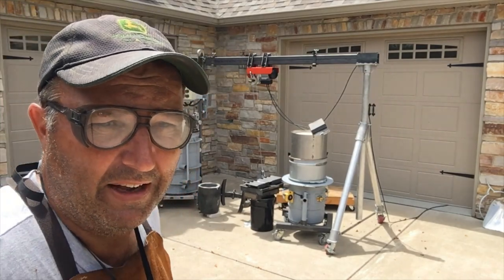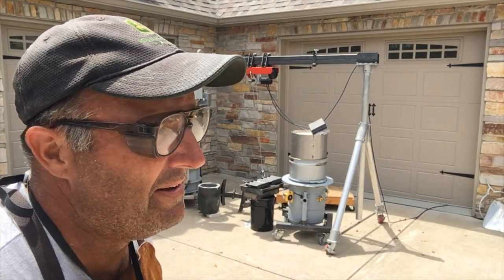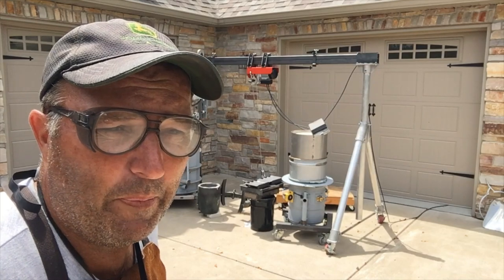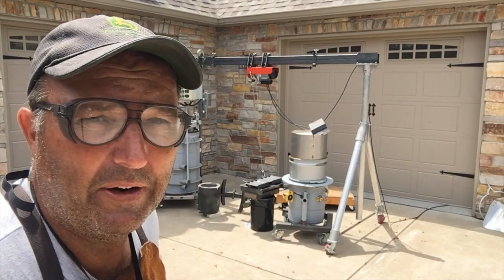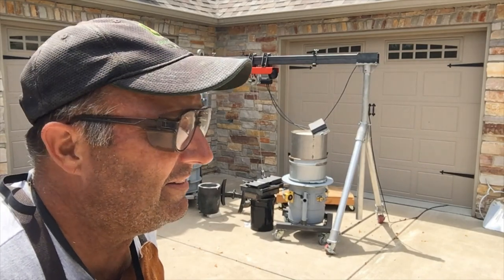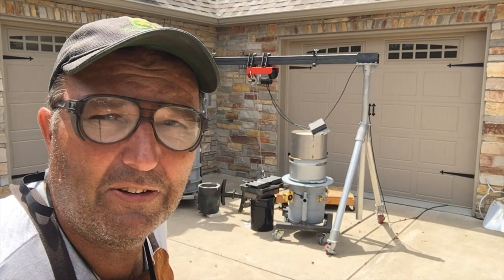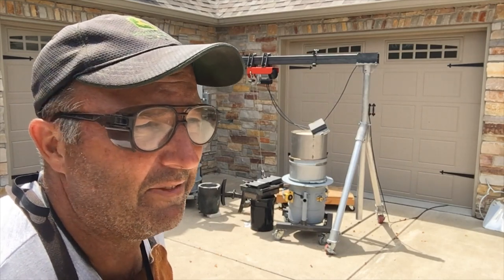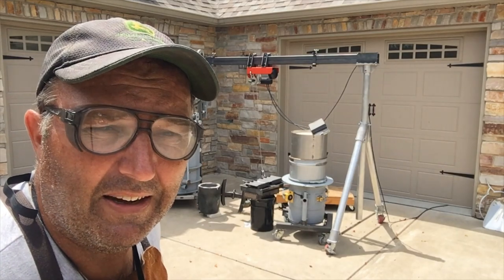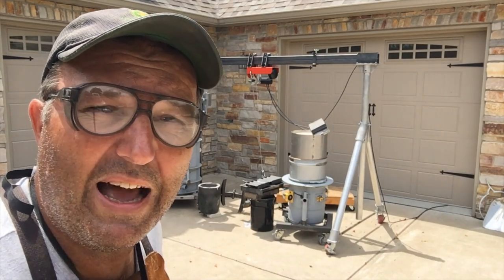I had the exact amount left over that I expected to. So most of the metal, enough metal, went into the mold to fill the part. It's just a matter of whether I had a stable mold and have a good part. One thing about lost foam casting and casting in general is you just don't know until you demold. So we'll give her 15 or 20 minutes to solidify in the mold, and then I'll dump it on the ground, demold it, and we'll see what we've got.